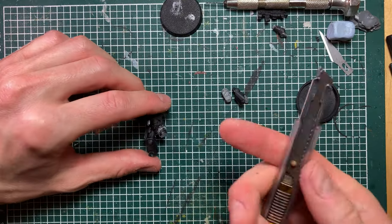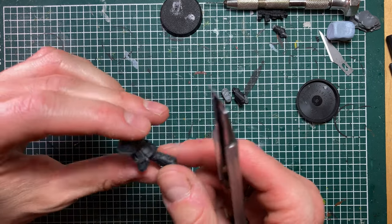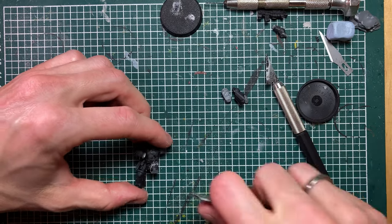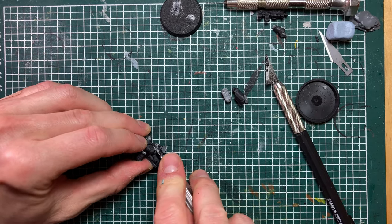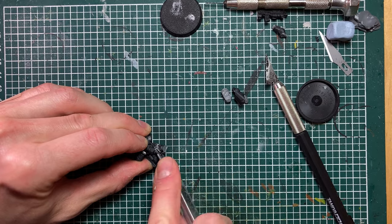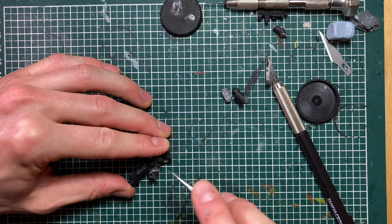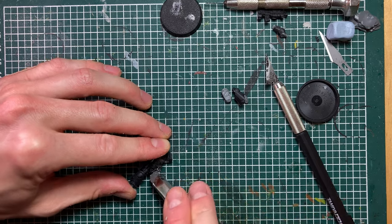Yeah, so now I'm going back to the knife again because the knife is thicker. If I put the thick knife in the very thin cut that the saw has made, I can put a little bit of force on it to actually push the parts away from each other. You can see that it starts moving. Again, watch out. This is the point where you start pushing force on top of a sharp object. And that's always a dangerous moment.